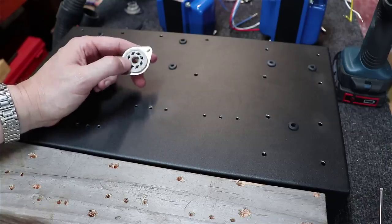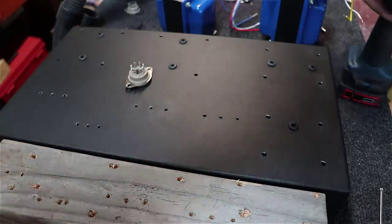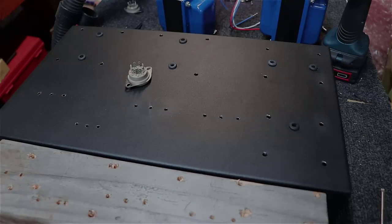But the bolt on the chassis punch that goes through the middle is larger than this hole. So we're going to use the same little stepper bit to get this center of the hole out a little bit and be able to drop the bolt through the middle to do the cutting.